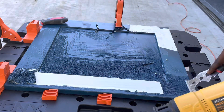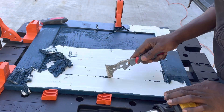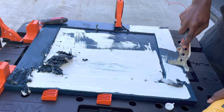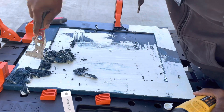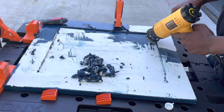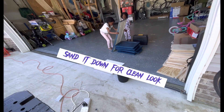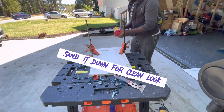With the chemical stripper it's easy to just peel the paint off, but it doesn't look as clean or as nice compared to what the heat gun and stripping tool will do for you. I personally prefer the harder way because it makes it look nicer. If you look at the side I used the heat gun on versus the side I used the chemical on, there is a difference — the heat gun side looks cleaner.